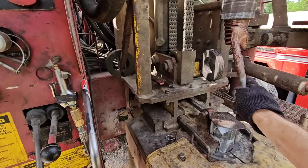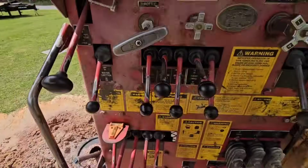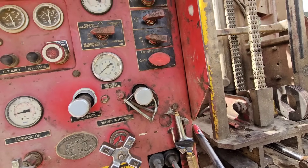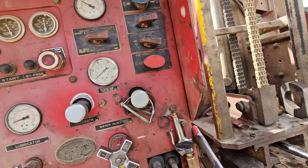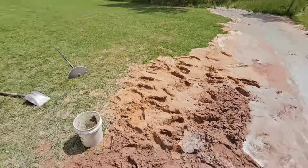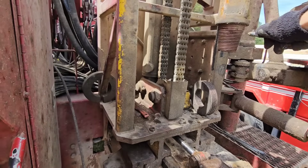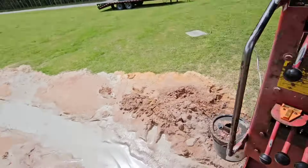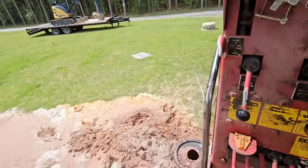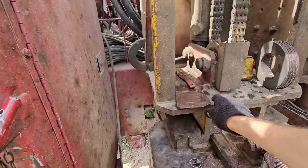If you don't use grease every time, it will seize the rod up in a heartbeat. The entire time you're doing this, it's essentially tightening every joint. Take the cap off, put the bucket, blow the threads clean, a little bit more grease, and down the periscope.